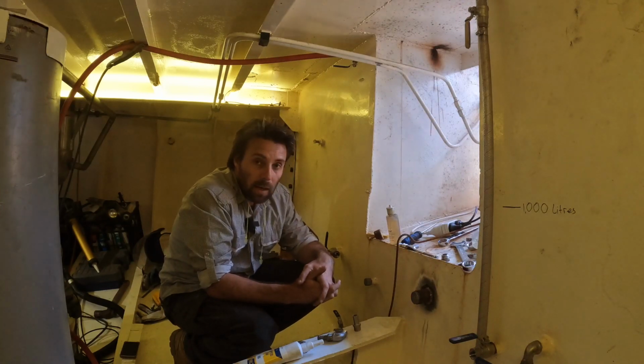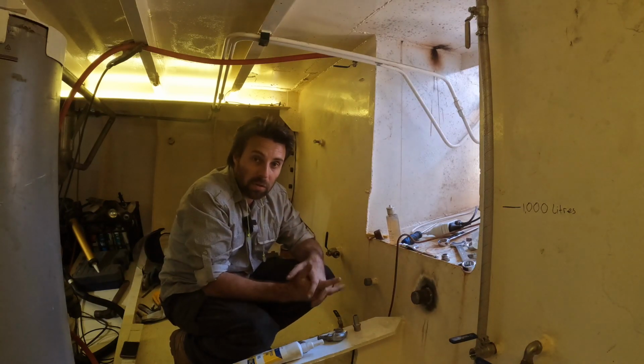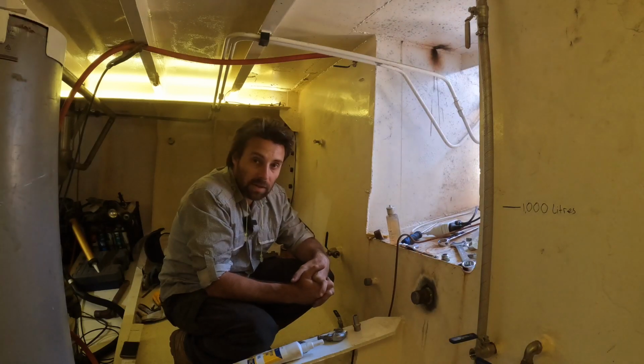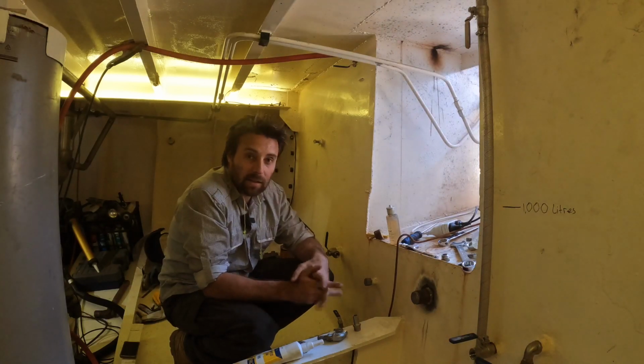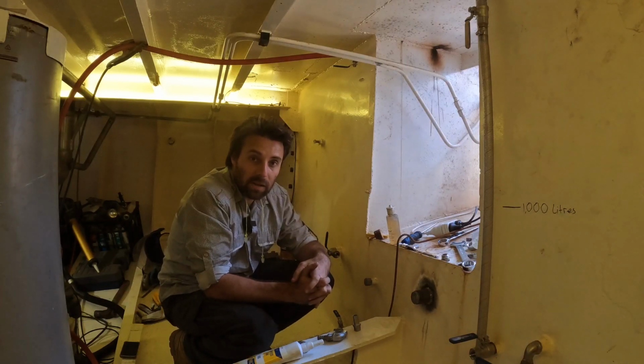I'm pretty sure it will. But yeah, that's my pressure test, essentially using diesel as a penetrant to push through. I don't need physical pressure. I'm going to use a penetrant of diesel to get through and see if we've got any holes. If that passes the test, that tank is ready to be signed off, in terms of we know that we can seal it up again.